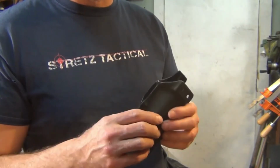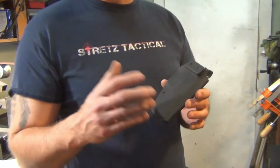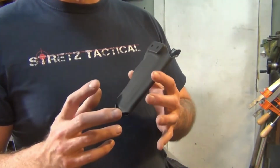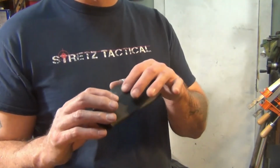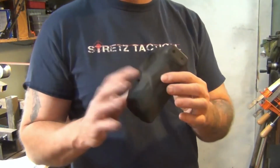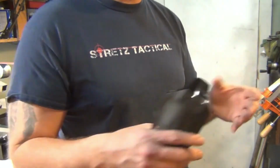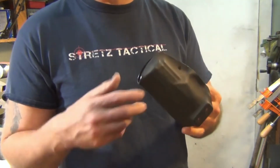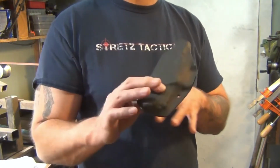and then you could do the final assembly. Now, that being said, do not use any type of harsh chemicals like acetone or gasoline or any of those weird turpentine. Any of that stuff will destroy this Kydex. All right, it'll discolor it. Don't use diesel, don't use any of those weird things. Hot soapy water or Simply Green with a little bit of water, scrub it in, and just either a sponge or a dish towel, and then just dry it out. And that's for the rest of the life of the Kydex. That's all you need to do.